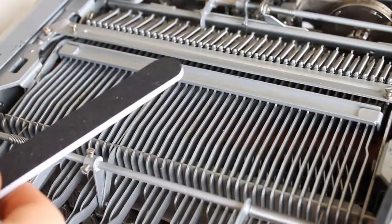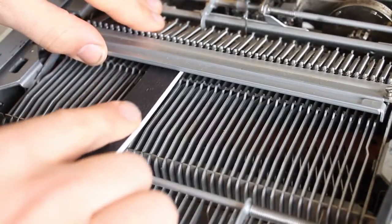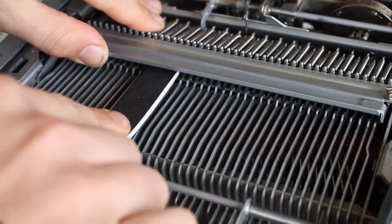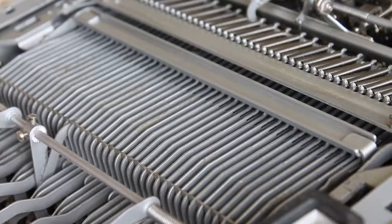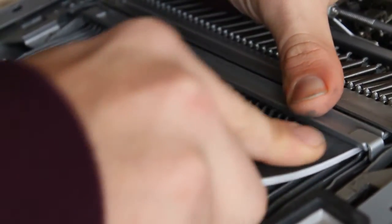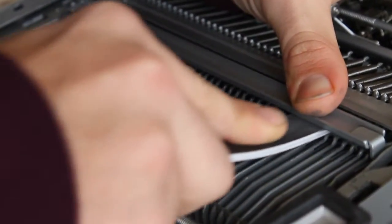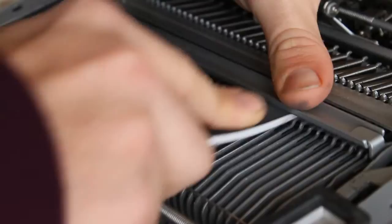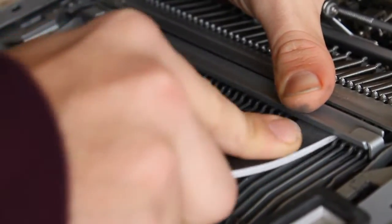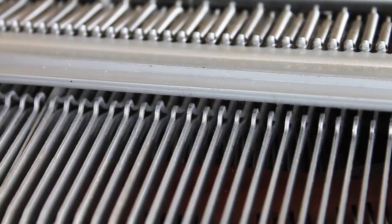Okay, let's get started. The first step is to scratch away the paint from the part of the key that's going to strike our electronic contacts. This will expose the conductive metal underneath. You can use a coarse grit emery board, a metal file, or some sandpaper. You can even use a Dremel tool with a wire brush attachment. When you're done, each of these little bumps underneath the crossbar should appear smooth and shiny instead of dull.